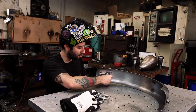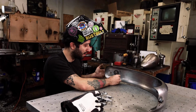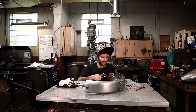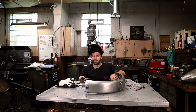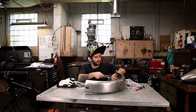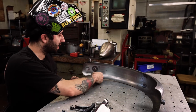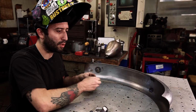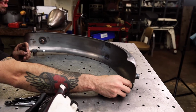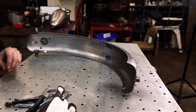just to hold it close so your wires aren't going to be drooping down and getting caught by your tire. So I usually get these, say about an inch away or so, and it's nice if you use a couple clamps and just clamp it on there, and then we're just going to silicone bronze these in a few spots equally spaced. So like I said, I like to take 2 and I put one probably pretty close, maybe an inch away, but fairly close, just so that bend is nice and tight out of the fender.